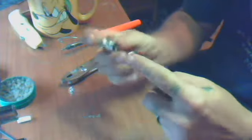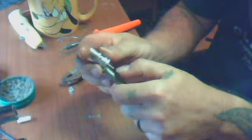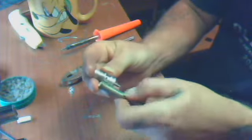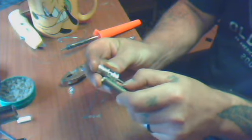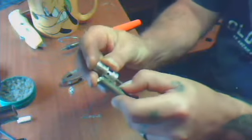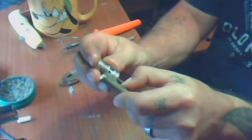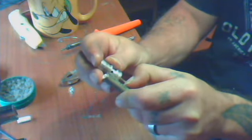Now, the end of the hot is going to have to come out of that tip. So what I like to do, what I always try my best at, is just kind of put them side by side like that. Take your thumbnail to the tip of that, to where the threads are at the tip of that coax. It's amazing how many people don't know how to do this, but we all had to learn somehow.